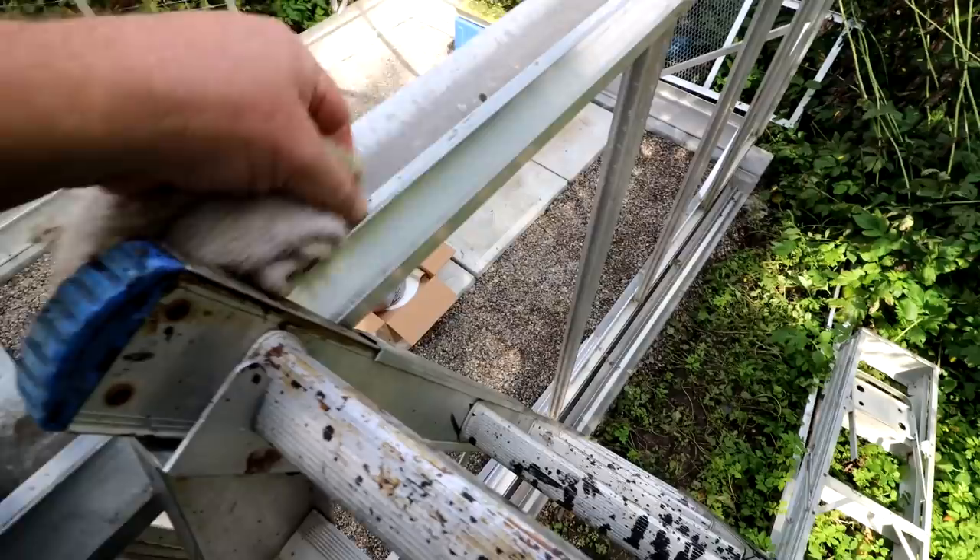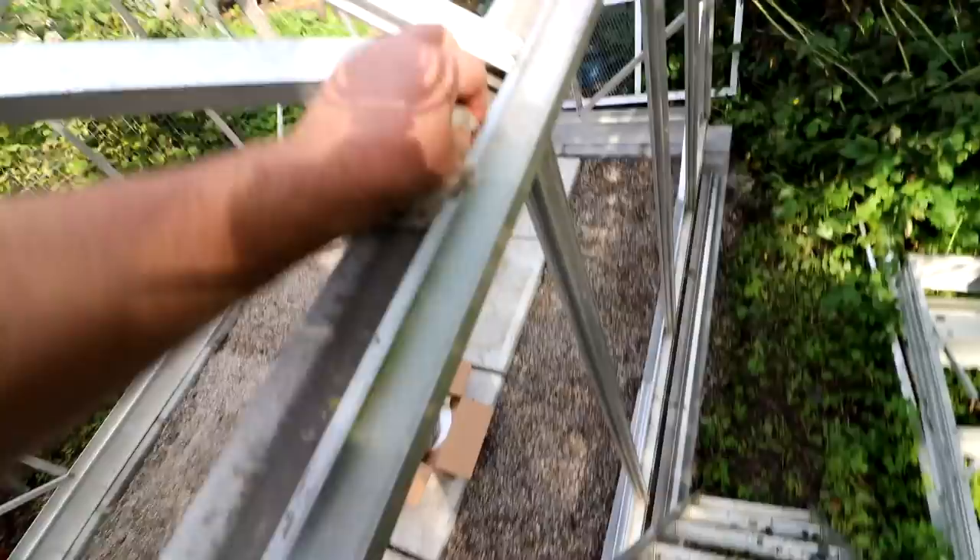Here's a look at the place where the putty is going to go. I'm just cleaning it with turpentine on the rag, getting any traces of the old putty off and cleaning out the drainage holes. I want to make sure it's nice and clean because once the glass is in, you can't get at this area. When we were taking this apart, there was all kinds of leaves, dead bugs, algae and water in here. So these holes will stop or prevent that.